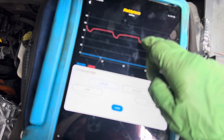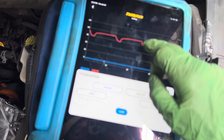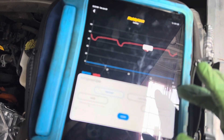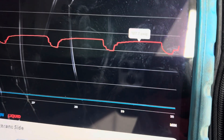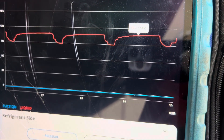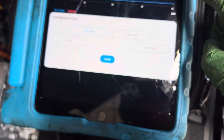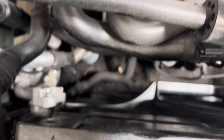Our pressures — see the dips in the compressor and the pressure. This is when it shuts off: 90 PSI. We're running at around 107 PSI on the high side. You're going to hear the compressor turn off in a minute. There — it just turned off.